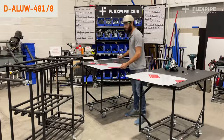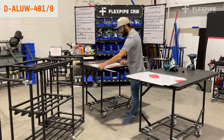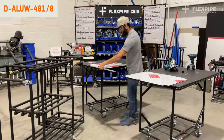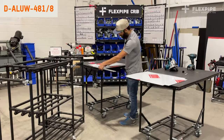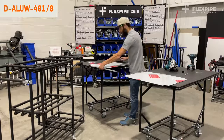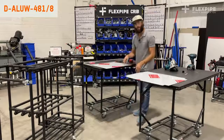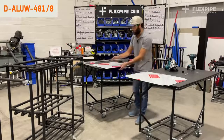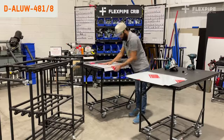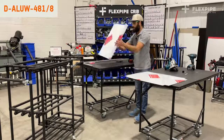What we want to do is mark it — take your measurement and mark it. I'm using a square, very much similar to a drywall square. We're going to score it, mark it, and make sure we have a nice line across. Once we have that, this works essentially very much like drywall — we can go ahead and break it, bend it, and flip it over.